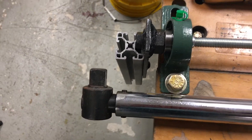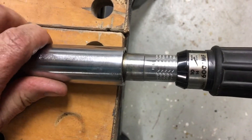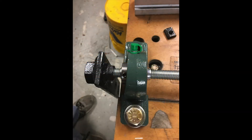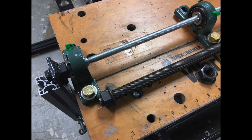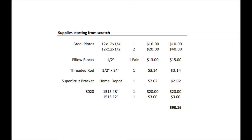So here's the really big guy — a three-quarter inch torque wrench with a range from 100 to 600 pound-feet. It's a good wrench to use for ARP studs due to the length. This setup will be okay for 200-pound calibration; I've been there. But the threaded half-inch rod is marginal at this point with its minor diameter at the thread root, and calibrating at 200 pounds is the highest load I'm willing to go. I have three-quarter inch threaded rod from the seal and bearing kit, so a new bracket will be made with $15 worth of new pillow blocks from eBay and a heavier table. Here are all the parts that you could use for something like this.